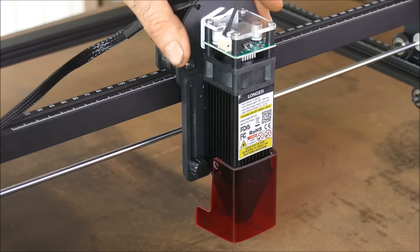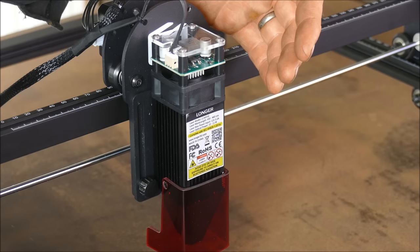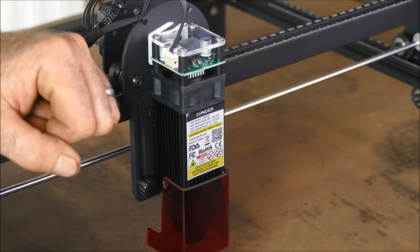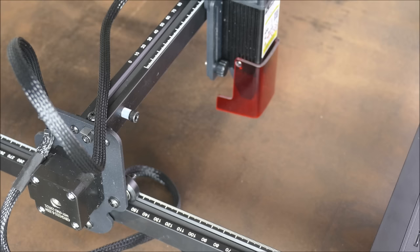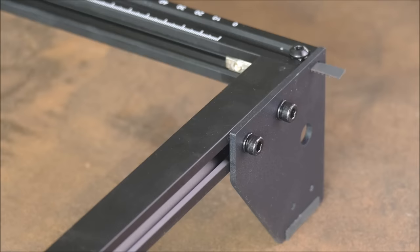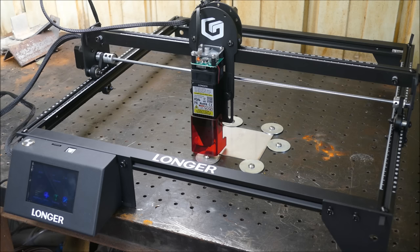With this machine you also get a 10-watt laser, very similar to the one we've used previously to engrave steel. We'll also test its function of cutting wood including 9mm thick ply. The cooling fan vents air to the nozzle, acting like an air assist, which is very beneficial for cutting and engraving. These measurements on the gantry are all in reference to the centre line of the laser, so you can get jig setup done really quickly. Pretty much all the parts are made of metal and seem extremely robust, and the instruction manual was very easy to follow.